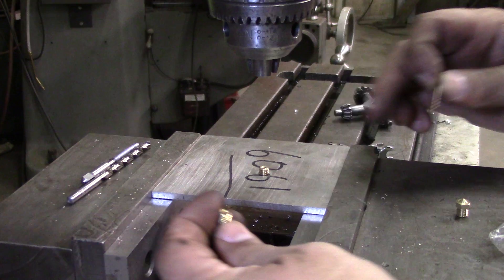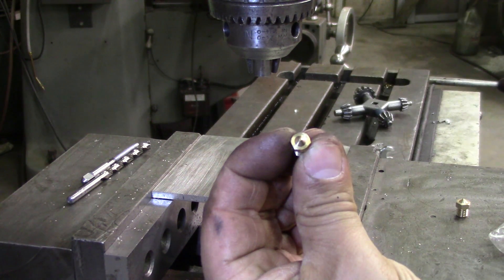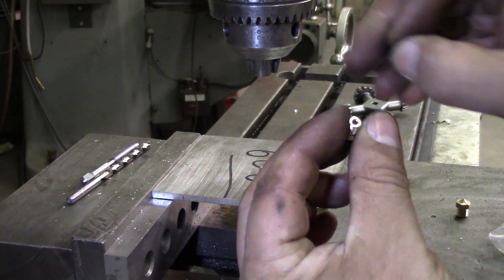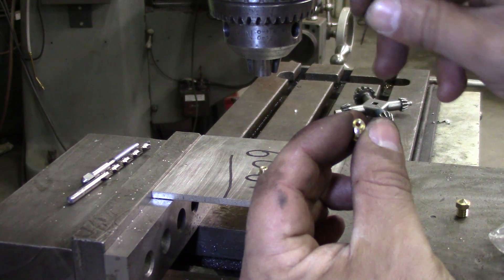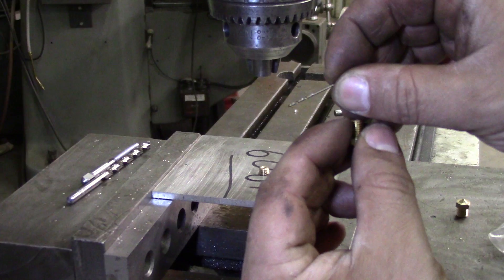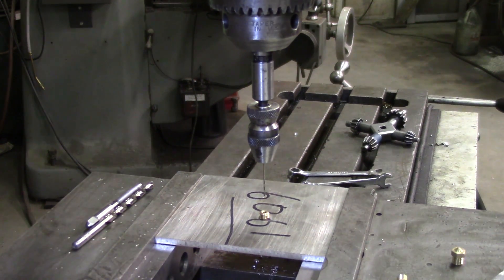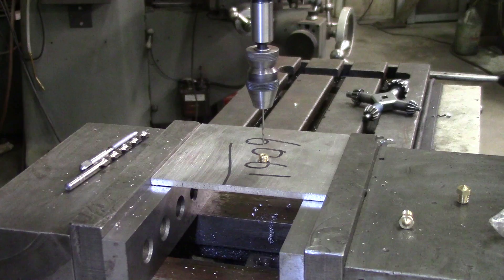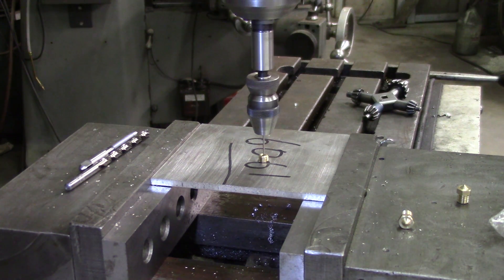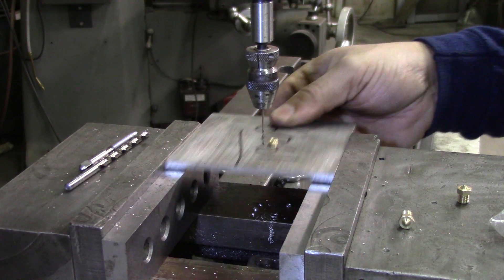So while we're here modifying these nozzles, if you look at the very tip, most of you will be familiar that the hole in that tip is 0.4 millimeters. I'm thinking wouldn't it be cool to have a nozzle that is one millimeter in diameter for the little Monoprice. I've already set up another nozzle. I've got to put a precision chuck on here — it'll be a chuck inside of a chuck — and we're going to open it up with a number 60 drill, which is just about one millimeter. That is it. It is just that quick.